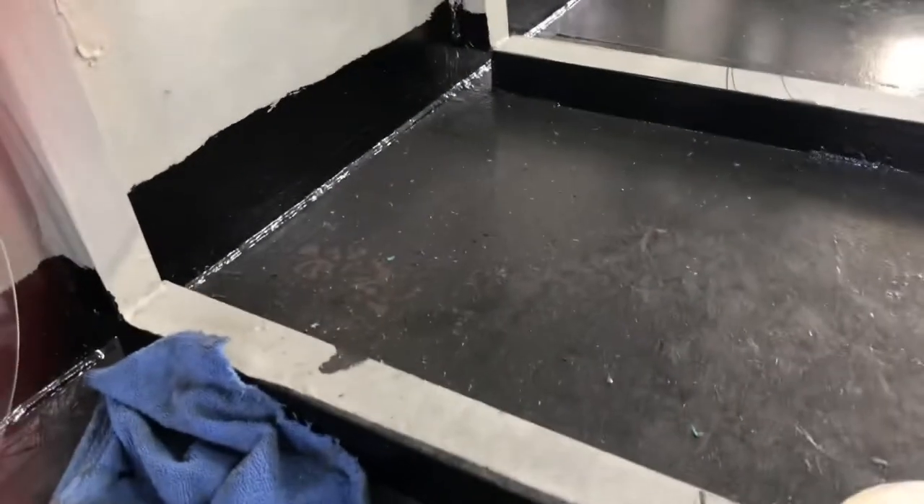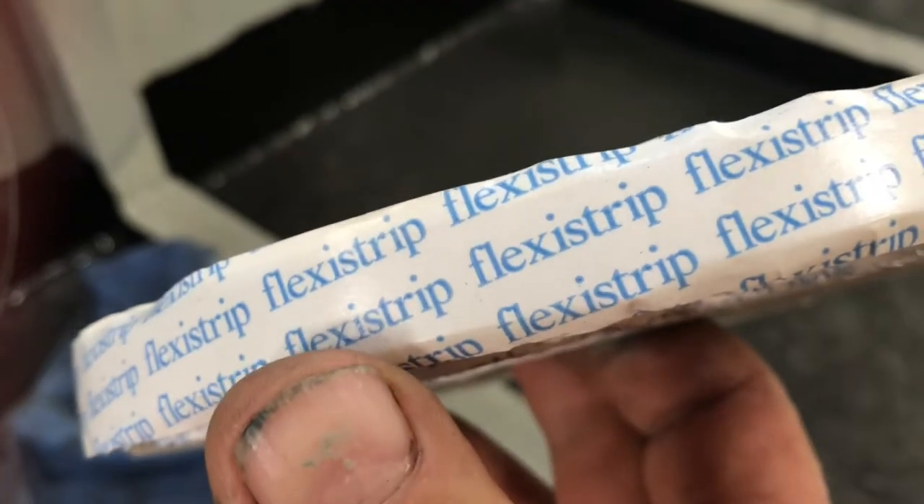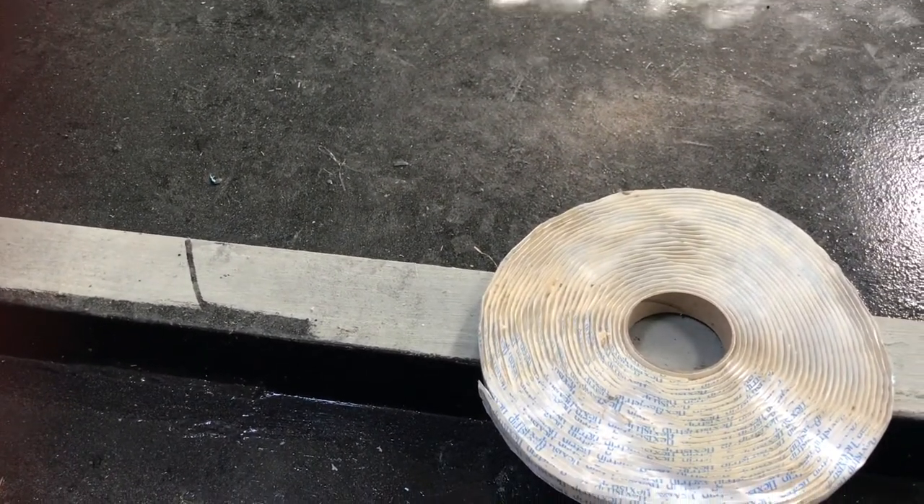From the inside — a bit difficult with the lighting — but here's my standard glazing pack fitted in there. The basic technique is sealing it using mastic butyl strips. The product I'm using is called Flex Strip, which I came across when building a house where windows are sealed to wooden frames with this compound. It's been in three years and it's absolutely superb — a nice seal.